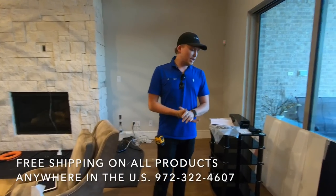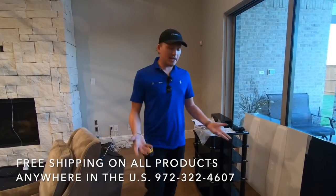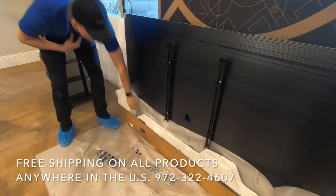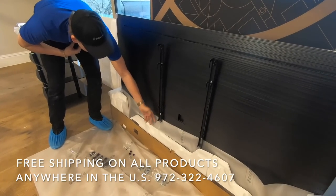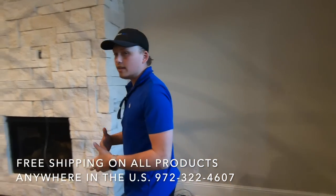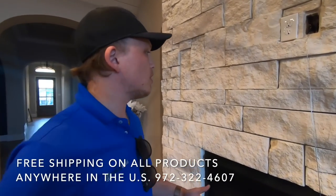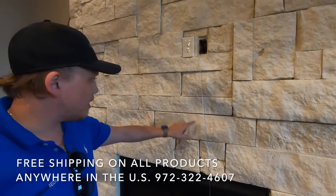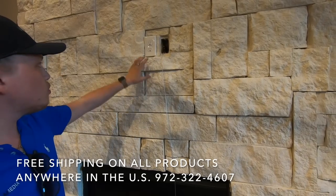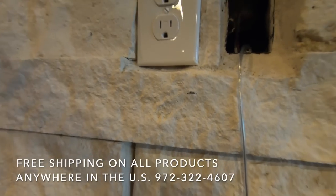All right guys, so we did some calculations that you can find here in the instructions, but basically what we did was we measured from the bottom of the TV, since there is no mantle we're using, to the bottom of this, which was 9 inches, and then since we don't have the center speaker right now, we just added an additional 3 inches of wiggle room. So we want the bottom of the TV to sit right here. So we measured 9 plus 3, so 12 inches to here. And that is gonna be where the bottom of the mount is gonna be.